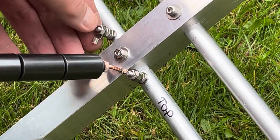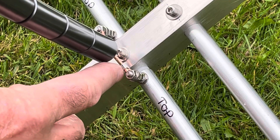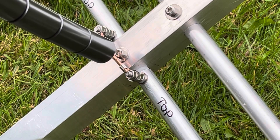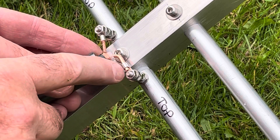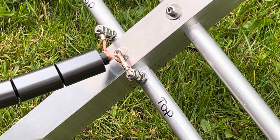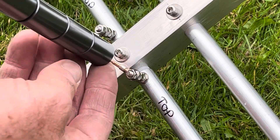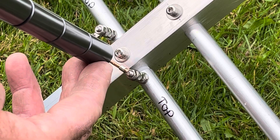The ring connectors need to be at the right angle for wherever the coax is coming off — in this case, straight up — so they need to be at a tangent to the coax lead. Tighten just enough to get into the connectors. The coax is going to come away from the boom, so I need to solder these connectors at 90 degrees, otherwise they'll be twisting the cores. Remember that when you take this off the boom for soldering.